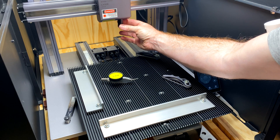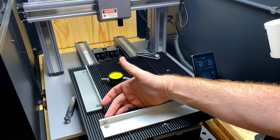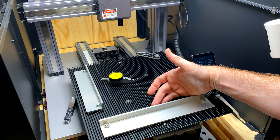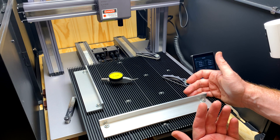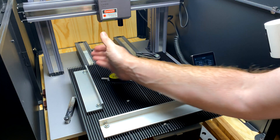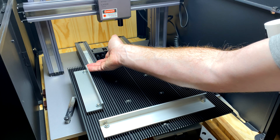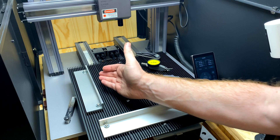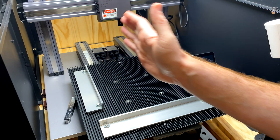There's always going to be a little bit of variation - this machine isn't super stout, it's a great machine and way better than most stuff on the market, but it's not a high-level milling machine. If you don't have a dial indicator, there's another way I worked out later: have the bolts just slightly snug, not tight, then bring the hood of the laser down against the fence and gently nudge it. Move the laser head all the way across and just let it nudge the fence so it runs nice and parallel.